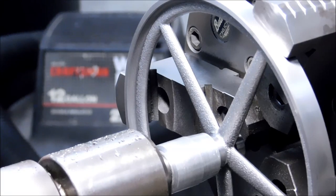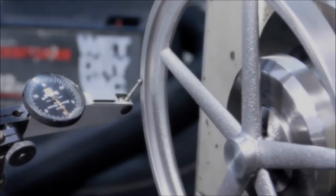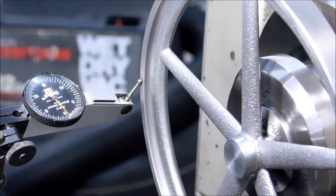We'll take it out and bore it and collet it. Pay attention to the diameters that you turn on the hubs on either side if you want to fit it in a standard size collet after the fact. One side of this one turned out to be 687, the other side is 673. This is not something you're going to see with the naked eye, and the reason I did that is because they both cleaned up at different places and I tried to keep them as close to nominal as possible.